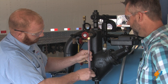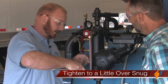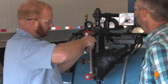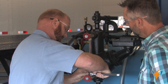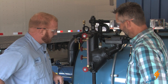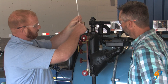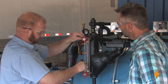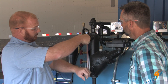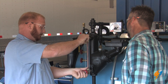Once you get those snug with your hand, pull out your crescent wrench — are you tightening them down tight? Just a little over snug. You don't want to go too tight so you don't break the glass. You can kind of feel when you're getting there — you know they're tight. We're not torquing it down. After you're in and you're good, put the rods back in to protect the glass and tighten the drain valve. Then at this point, crack these valves back open — that would let water flow back to the glass. You want to backseat these.